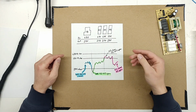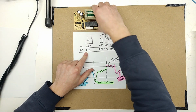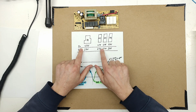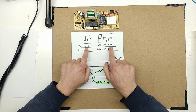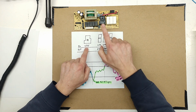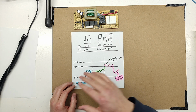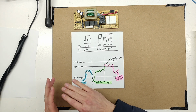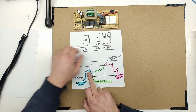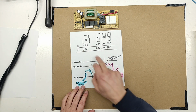I did some experimenting. This is the voltage each of these relays drops out at. So you can see about 1.8 volts. But look at the voltage they pull in at. See the difference here? This little one here is a full volt lower than this one. So you could have the power supply voltage for the relay coils dropping, and it could still be high enough to keep all the relays closed. If it drops below 1.8 volts, all these relays drop out. 1.7, 1.8, somewhere in there.